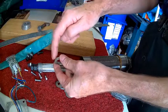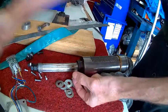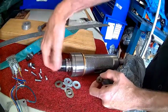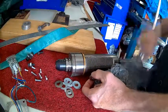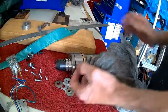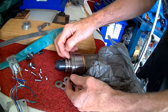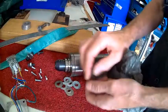But if you flip it the other way, the force is still one but the deflection is doubled. So when it pushes down to lock the quick change collet, you need enough force to pull it tight so it doesn't come out, but you also need enough movement so the air cylinder can push the Morse 3 collet out and release it so it drops out.